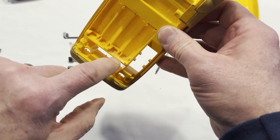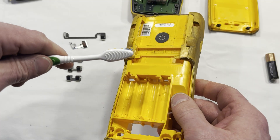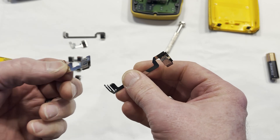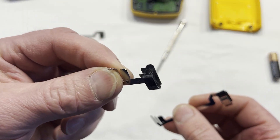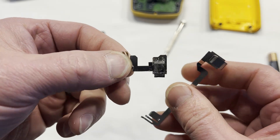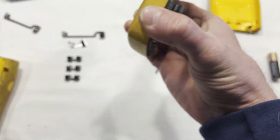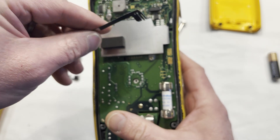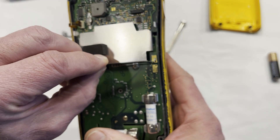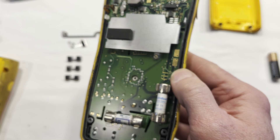I'm going to wash out the rest of this corrosion before I put the new clips in — I'll just use an old toothbrush to wash it out. Here's what the old ones look like: that one's corroded, this one was corroded and broke this pin here. Those pins contact the pads here, and the corrosion all over them kept me from powering up the Fluke with the new batteries.